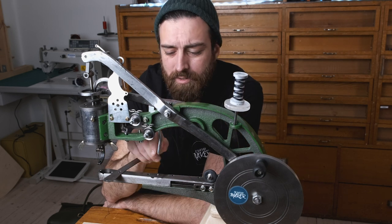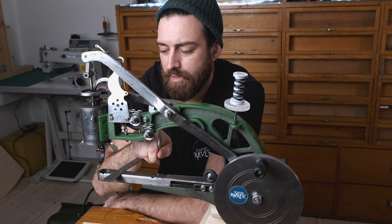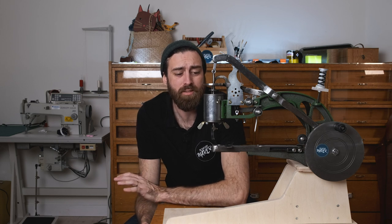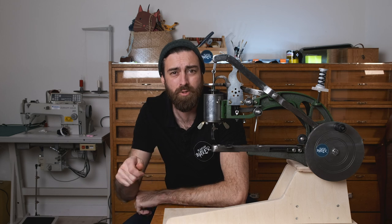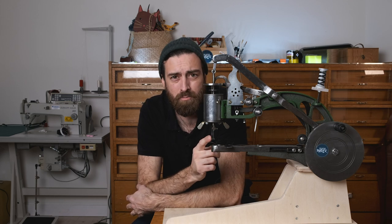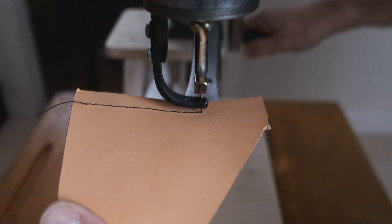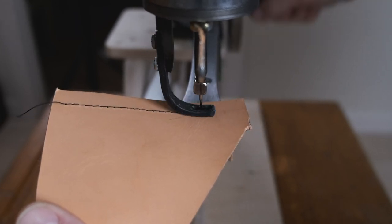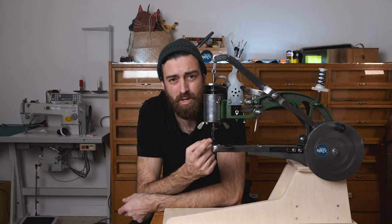The spanner is here on the back of the machine so it's pretty easy to reach it and lift the presser foot. The main issue I've had is getting a straight stitching line, and to remedy that I used a stitching groover to cut a straight line in the leather beforehand. Another thing was getting the presser foot to move the leather without leaving any marks — I sanded down the teeth a bit and added some Plasti-Dip and that seemed to work okay.